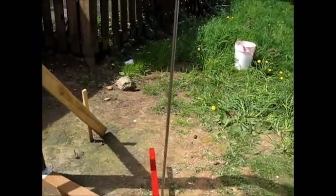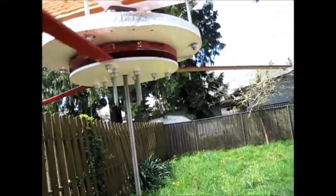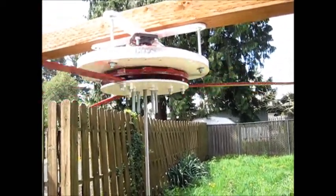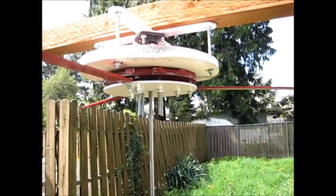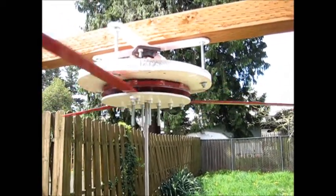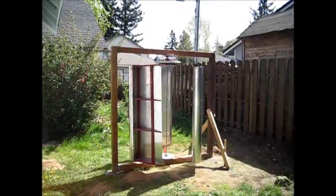I've got about a two to five mile an hour breeze coming through here — just enough to kind of shake these a little bit, nothing much — but it's channeling right through this area where I'm going to be set up. It spins up pretty nice. I've got to see if these blade arms are going to be too long. I'm going to try to match the RPMs to daily wind speed so it'll work okay with the 12-volt system for now, unless I go to 24-volt. Let me start attaching these wings and we'll keep updating you. See you later.